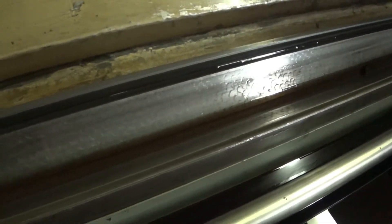We pulled the way covers on this machine to give you a sense of how nice the ways are. There's no scoring at all, and the flaking is apparent all the way the whole length — that's just oil. The ways are beautiful on this machine.